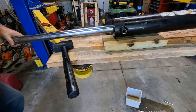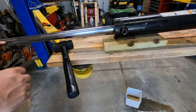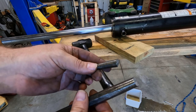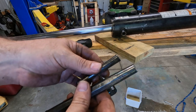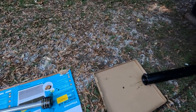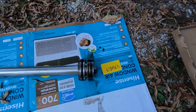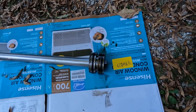It's slowly coming out — it's stiff. I hope that cylinder inside the bore hasn't been damaged. That rod and cylinder's tough — broke my punch. What I had to do, I had to hook it between both trucks and pull that piston out. Hopefully my bore right here hasn't been damaged. That was very hard to get apart, so I just had to hook it between both my trucks. So we got it apart, and now we can go ahead and start rebuilding it if the bore is good.